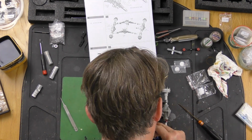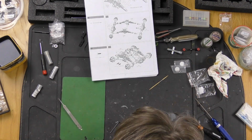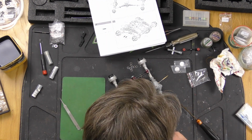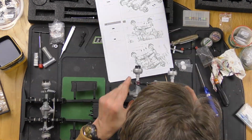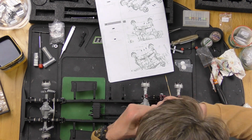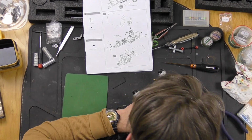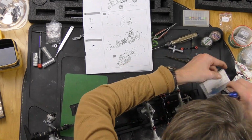And the rear axle is fairly straightforward. It's a little bit of a fingers and thumbs job. To help you, I would recommend that KDL006, which is a sort of curly metal piece that sits between the two leaf packs, you leave that out altogether until you've got to step 43. So you put the leaf packs and the axles on the chassis and then put the metal piece in and put the clamps back on the leaf packs. Otherwise, you'll have trouble getting all the bolts between the leaf packs and the chassis.